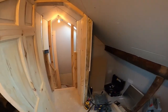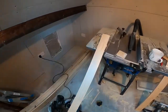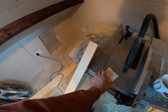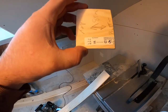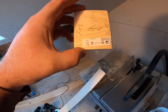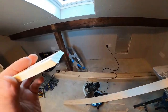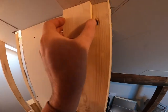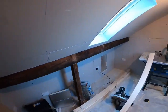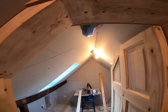The final stage is the door frame — I'm putting the edge and trim on. Because this is a homemade door frame I've bought this stuff from B&Q. It's 11 mil thick, 92 mil wide, and 2.4 meters long. Unfortunately I only need 85 mil wide so I'm going to cut it down on the table saw. I've cut an angle on a template piece — the theory is it goes on like that with a nice angle top to bottom, and when you close the door it'll come up to it nicely.